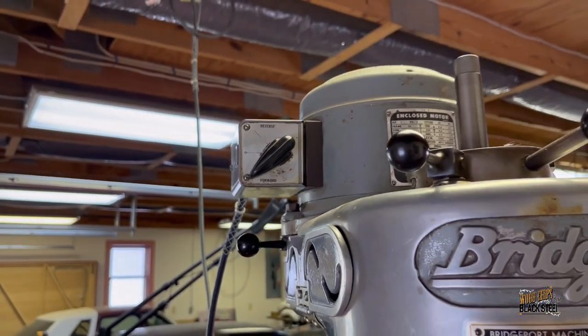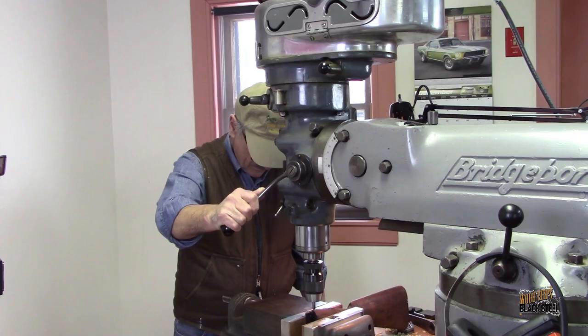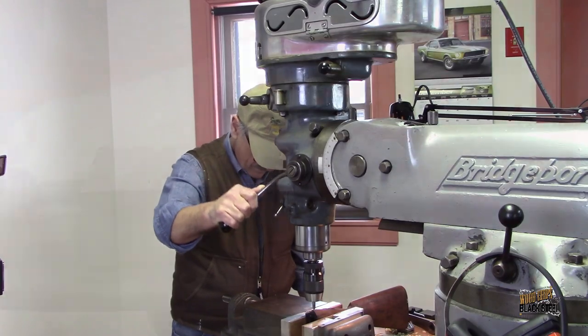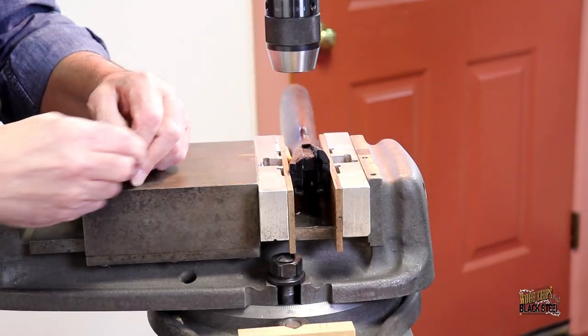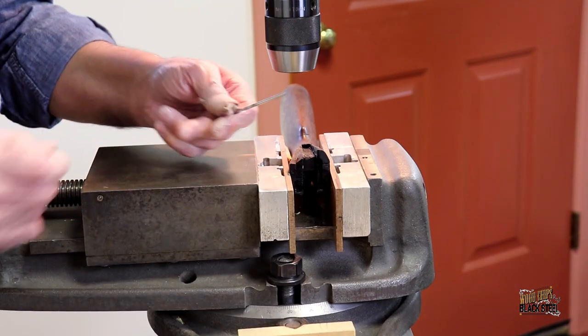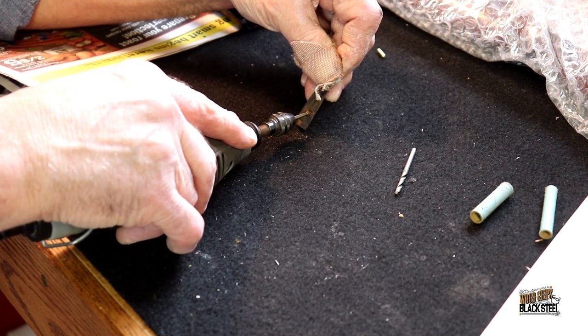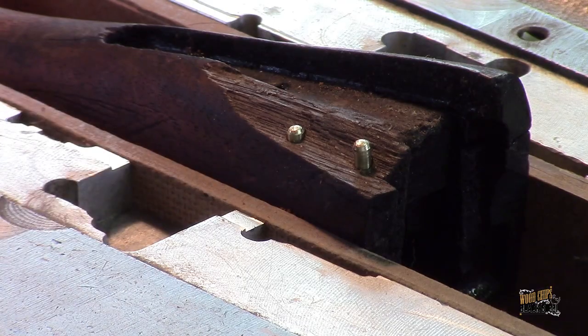With the Bridgeport, and after clamping and leveling the buttstock in the mill vise, we used a typical 2-drill process to size and drill the hole that the brass rods would fit into. The broken ear was so small and odd-shaped that we decided to use a Dremel and a ball mill to hollow out the location for the dowels on it. This was tedious work, but in the end the fit was amazing.